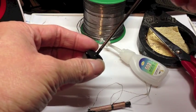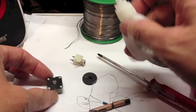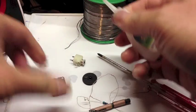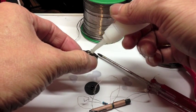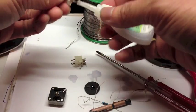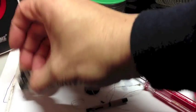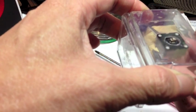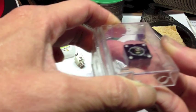Put this variable capacitor in place. Take off the cap. Apply some instant glue. Be careful not to touch the middle, otherwise the tuning will be fixed. Then mount it on this. Okay, count to three — one, two, three.